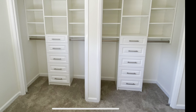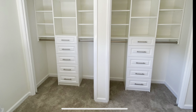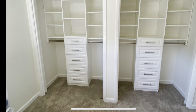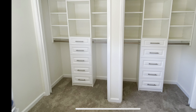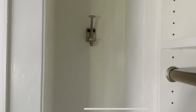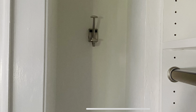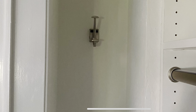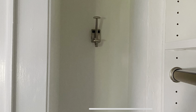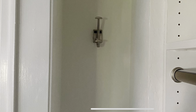We had several closets in that house that were wall mount, and just one closet with floor mount. I don't always know the reasoning and that's fine — sometimes there's a good solid reason. But the point is, because of the baseboard changes we had to go and notch out all those floor mount pieces. Had it been wall mount, it would have matched the rest of the house and we wouldn't have had to do anything. Also, we had several large coat hooks that weren't called out on the plan on a reach-in closet, and we didn't have any nailers for them. Reminder: any time we do hooks, they need to go on a cleat so they're securely fastened to the wall and easier to install — we won't have any issues down the road.